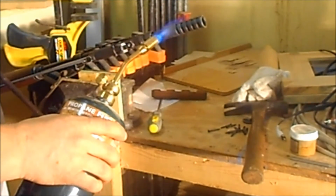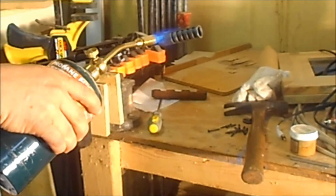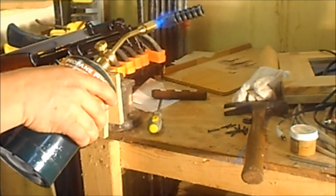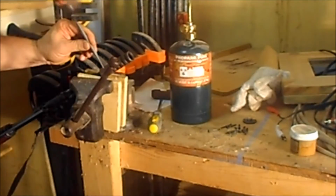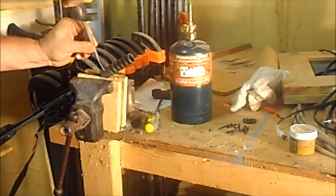Next thing to remove so you can reach 922R compliance is the grenade launcher. The grenade launcher is screwed onto the barrel and then pinned. To remove it, you need to first remove the retaining pin. I applied a little heat in hopes of making the removal of the pin easier. In hindsight, the heat may have helped unscrew the launcher from the barrel, but had no effect on removing the pin.